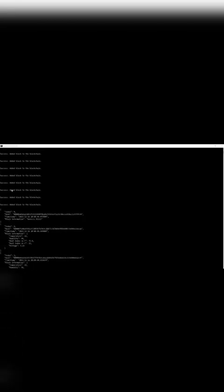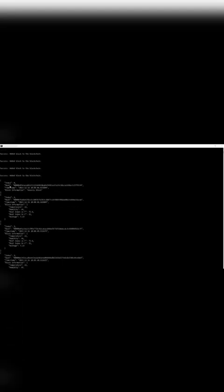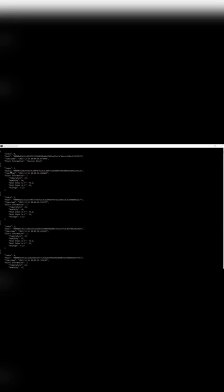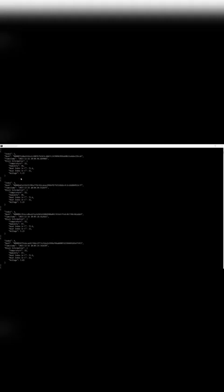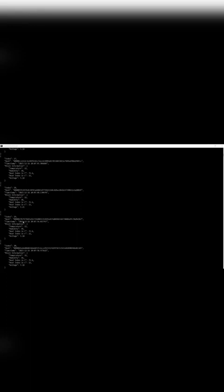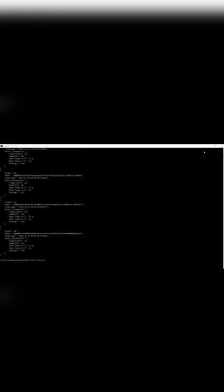I have set this project to retrieve back all of the stored blocks in the blockchain. Index 0 is the instantiation block, which is the Genesis block, and the following ones are the data itself. We can see the index, the hash, the timestamp, and the block information itself. In my sample file, I have 20 different blocks for 20 different readings directly from the system. So it will print out all of the retrieved blocks from the blockchain. And this wraps up the blockchain implementation.